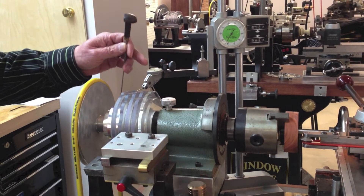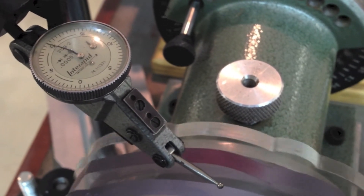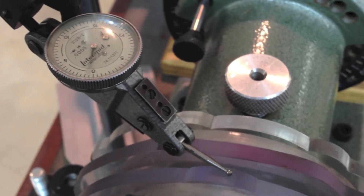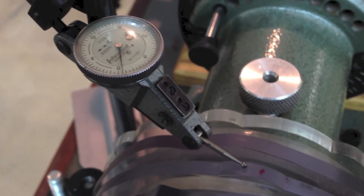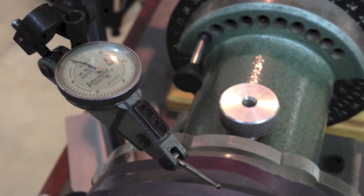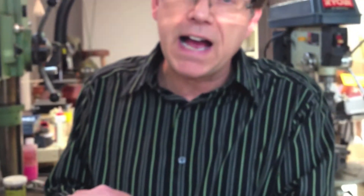Let's go over the rosettes for a minute. Taking a look at these rosettes, it's about five over on one side and about five or six over on the other — so basically this rosette is only off-center about five and a half thousandths, or two and a half thousandths on each side. For a rosette, two and a half thousandths on a side is acceptable.